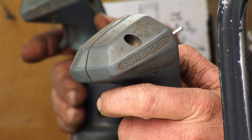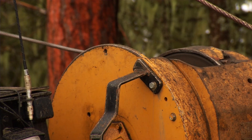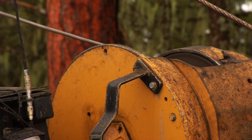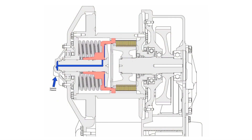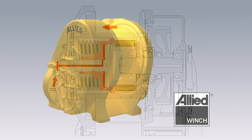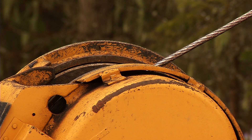Let's take a look at the unique design that makes the gravity reel-out possible. This is an exclusive design found only on the Allied WH 400 yarder winch. It is a spring-applied, hydraulically-released, multiple-disc clutch located inside the drum. Disengaging the clutch allows the drum to reel out the carriage by gravity. The operator can slip the clutch to modulate the line-out speed. The clutch is constantly cooled by hydraulic oil. This same Allied WH 400 winch can also be used as a single winch system on an excavator yarder for selective logging.